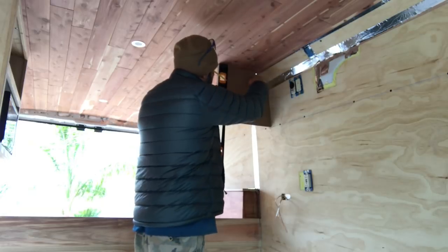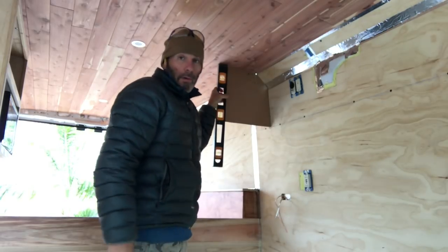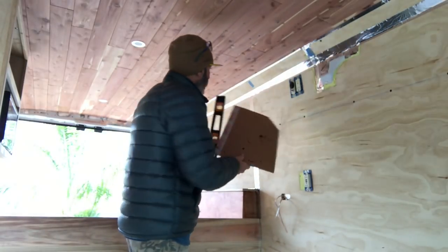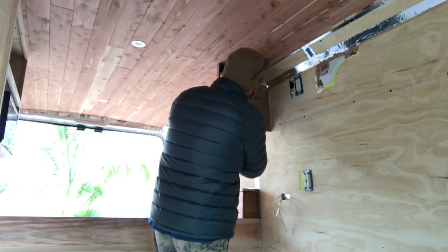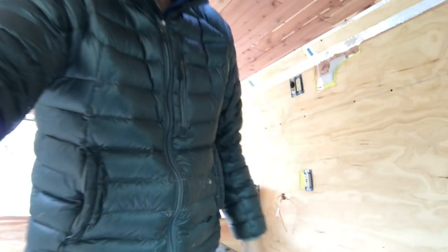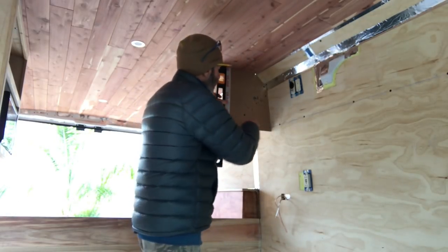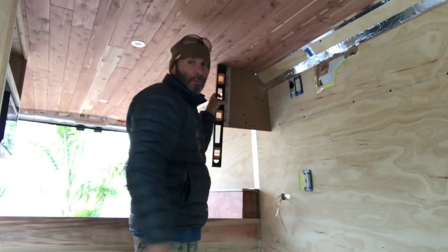Usually somewhere along the line I whittle it down so far that I lose how big I want the box to be. Then I have to trace this on a piece of new cardboard and add a half inch here or some to there — but that contour is always the same. So there's the just-finished contour and it's plumbed, but now it's about a half inch short. I made a little mark of how big I want the cabinet to come down to, so I'll trace this on a new piece of cardboard and add this length to the bottom. Here's my new piece of cardboard. See how that fits. Needs just a little bit right here, so I'll take the belt sander to that. So that is perfection. That's one down, two more to go. It fits the contour here, it's got the right dimension along this edge and that edge, and it catches this piece of wood.